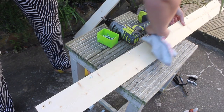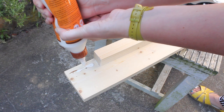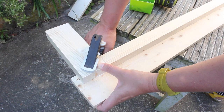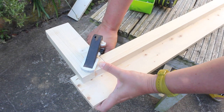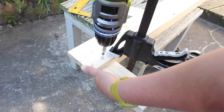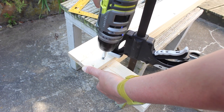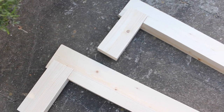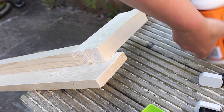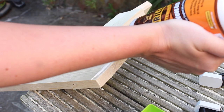Wipe away any excess wood glue, then apply wood glue for the leg. Put the leg in place and use a clamp to keep it in place. Then flip your planks over and use a corner square just to make sure your leg is at a 90-degree angle, and screw it in place. Make the other side of your daybed in exactly the same way, so you're going to end up with two pieces of frame like this. Now it's time to put it all together — apply a bit more wood glue on the side and on the leg.